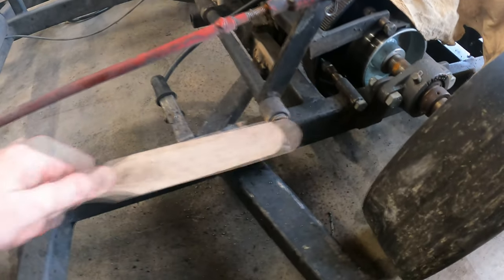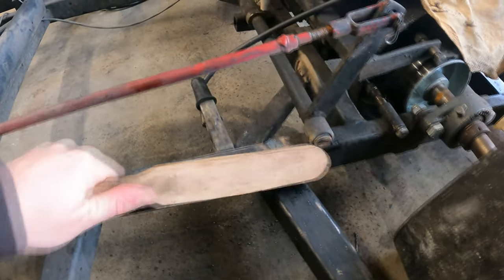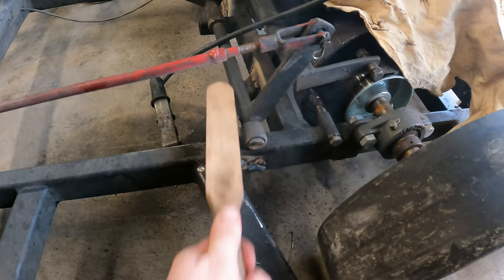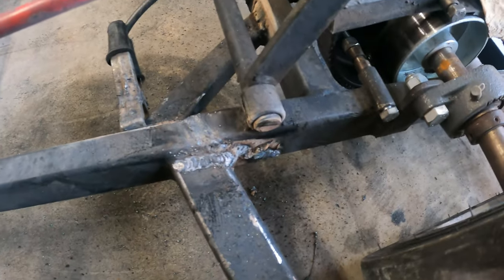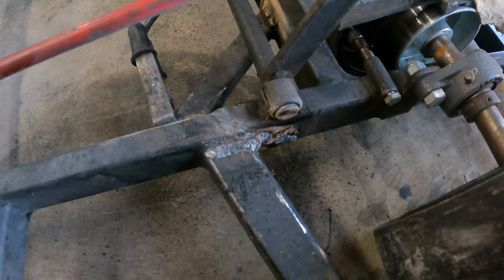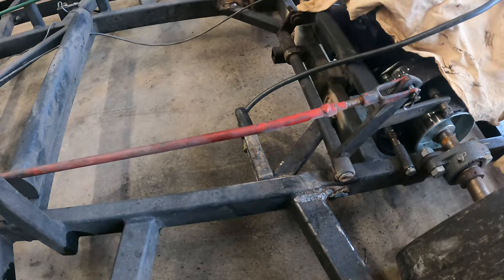Let's see how the flux turned out. It didn't look like it was going on perfectly, but I feel confident about getting a pretty deep weld on most of those — at least the ones I could actually see. A lot of this is so low to the ground it's hard to tell, but it's a lot better than it was. I also laid welds on spots that didn't necessarily look cracked, because if the metal broke through in one spot, there's a good chance nearby spots will too.